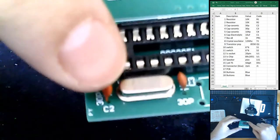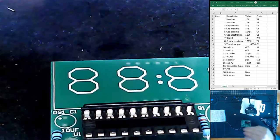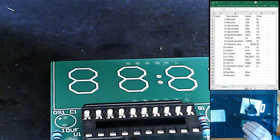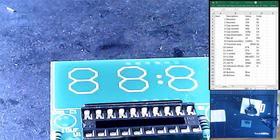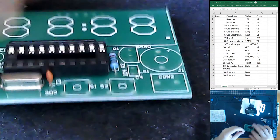So what it can do is, this over here is a 12 megahertz crystal oscillator. That means it's producing an oscillation 12 million times a second. So if it wants to know when every second passes, it just waits till it counts up to 12 million. It sounds a lot harder, but for computers, that is actually a lot easier. Just counting to 12 million, no problem. We can literally do that in less than a second. Humans, not so much, but a human can count to 60 to know when a minute has passed. So, you know, everyone or everything is different.